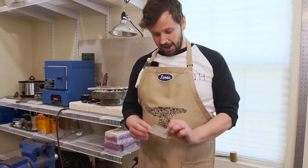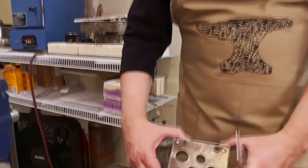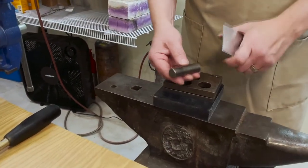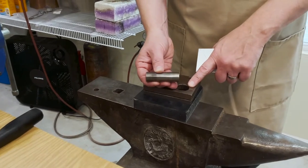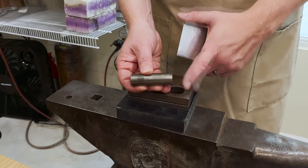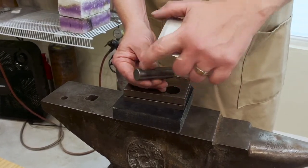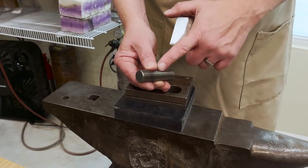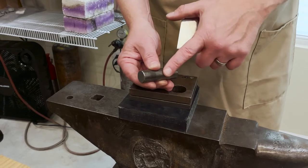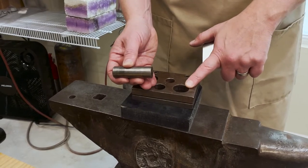I have this aluminum that's not annealed and I have the disc cutter ready. There's a variety of different sizes and I've matched up the punch with that. An important thing with the disc cutter punch is you never want to mix up the cutting edge, which is completely square and flat, versus the impact or striking side that usually has a slight bevel to it for striking with a hammer and to prevent mushrooming from heavy use. Don't ever mix those up or you're gonna run into some problems.